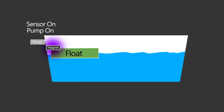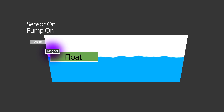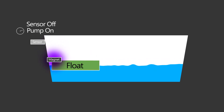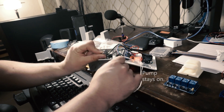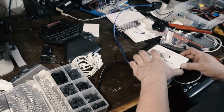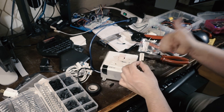Since the magnetic sensor doesn't measure depth — it's just on or off — the pump used to turn off as soon as the water level dropped enough that the magnet was out of range. But I want the pump to stay on much longer, so I added a little timer. Now the pump remains on for at least 30 seconds, or until the magnet goes out of range, so I get much more water out before the pump turns back off. And at any time I can tweak those 30 seconds to whatever I want — I just have to time how long it takes the pump to get all the water out.